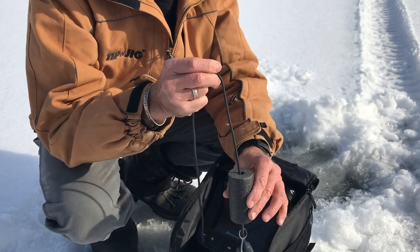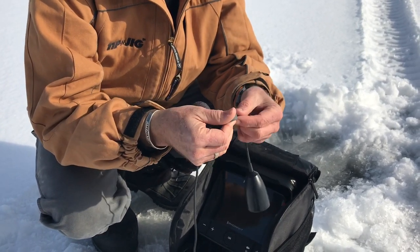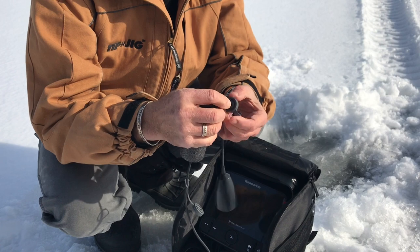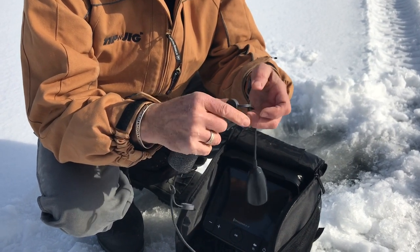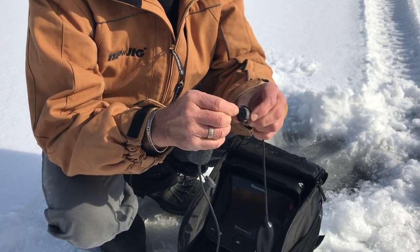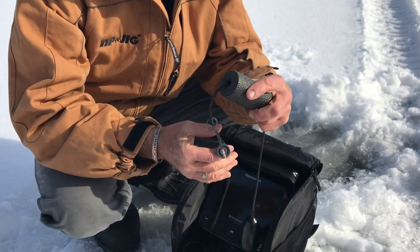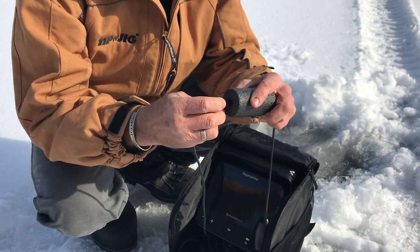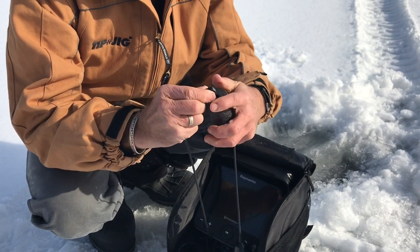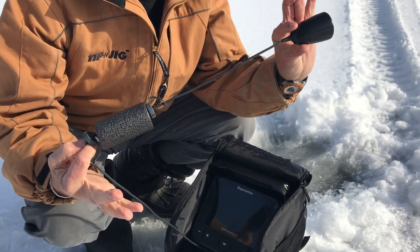There's a really nice system to suspend your transducer so that it's the right depth just below the bottom of the ice. You can see there's a piece of foam here — it's like a float that travels up and down. You also get these little plastic stoppers. What you do is slide the stopper around the cable. In the middle position it still slides up and down, but if you push it back it tightens and locks. I'm going to push the cable back — right now it's not going to slide anywhere. That's about a foot and a half. I'll take the floater and put it flush to the bottom one, then take the top one, slide the cable inside that plastic ring, slide it to the right position, and lock it. This is the length I'm going to have from the stopper to the transducer.